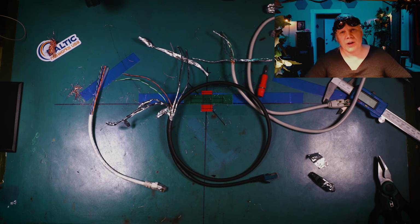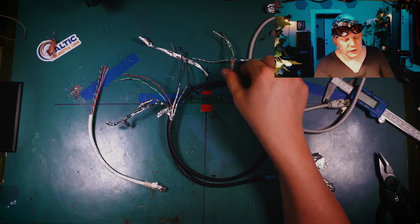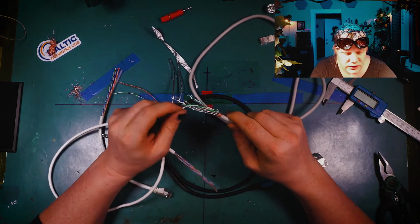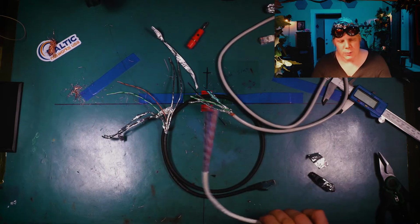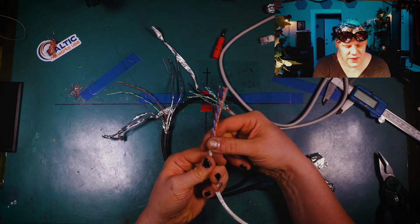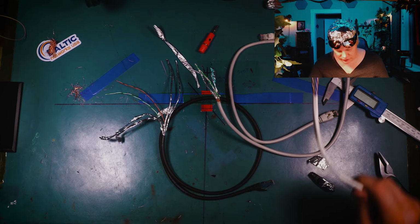Now, the tough cable carrier from Ubiquiti, there's also a Shireen, and there's another product out there that's the same, where basically it's got the braid over top of the pairs, but it doesn't have the internal foil. So imagine a cable just like this, except having foil over the top of that, and then having the braid over top of the foil, and that's what the tough cable carrier is like, okay?